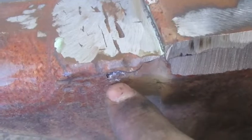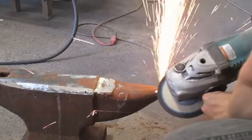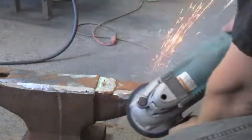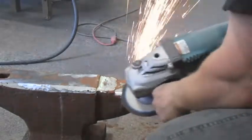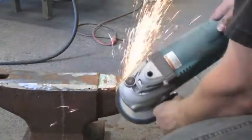And you can see it there especially, and there, because the steel face goes across the whole thing, even to the horn. You can see the sparks here are high carbon sparks — or at least you may be able to see that on video. With Vulcans, the way that they are made, the whole steel top from the heel to the tip of the horn was all steel.